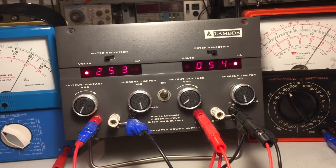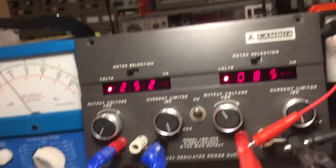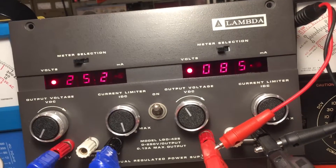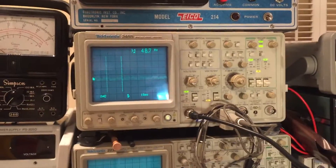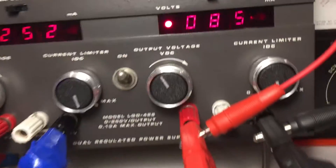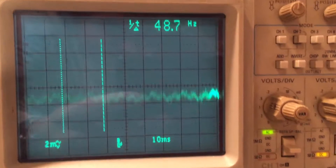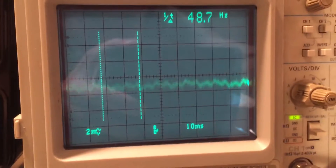That's not the whole story. To check a power supply, you've got to do a little more than just measure the voltage and check that the current limiter works — you've got to check the ripple. I've got my 2465 attached through a BNC cable, essentially a 1x probe, directly to the output of the power supply. It's currently putting out 85 volts. We've got our bandwidth limit on at 20 megahertz, which is indeed what Lambda spec'd this power supply at. We're on the 2 millivolt scale.